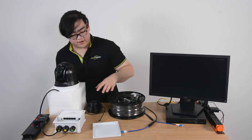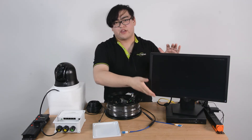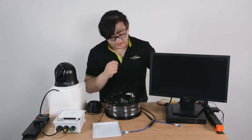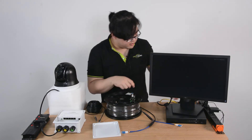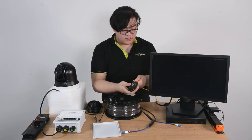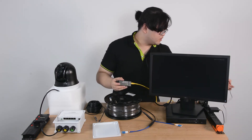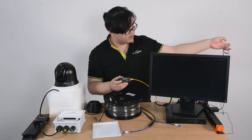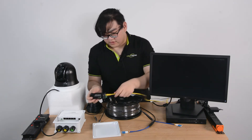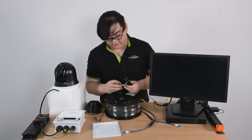So once we have this set up on the other end, now I'll show you guys how to step-by-step set up this whole camera system and see the image on the camera. First, let's go to our main network system — we have a monitor and an NVR. We're going to connect our fiber optic cable to the NVR. So first we take our media converter and connect it to the NVR. This small media converter is our Fast Cabling model and it works on 12-volt power, so it's really easy to power up. Now we have it connected to power and all the indicators are on. I will now plug in an SFP module.